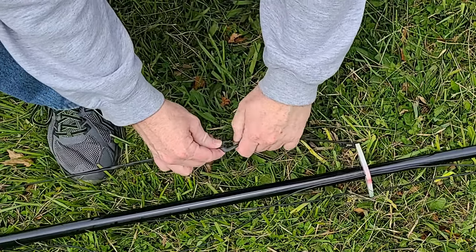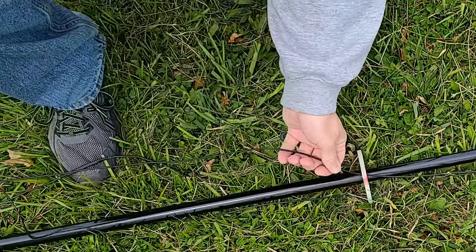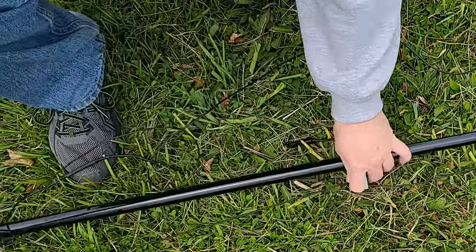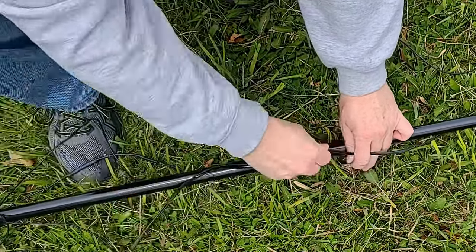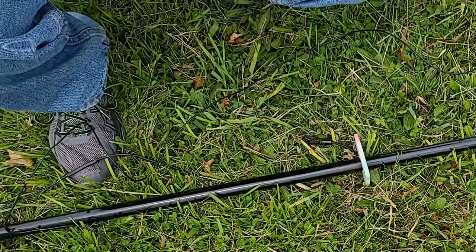Okay, on my way back down the pole, I'm gonna stop here to unhook the 20 meter element, and I'm gonna go ahead and pull the 30 and 40 through this top guideline while I'm here. Sometimes they get a little bit hung up if you're pulling them from all the way down at the bottom, and this just saves me a trip back up the pole.